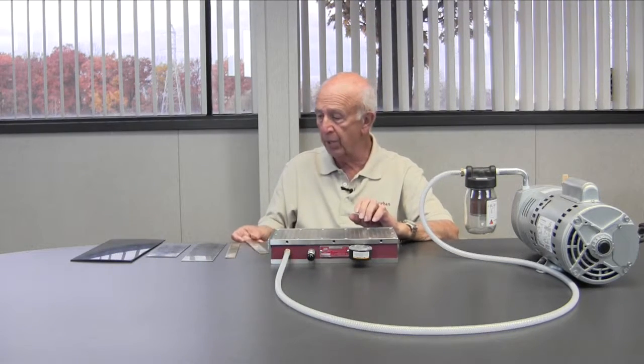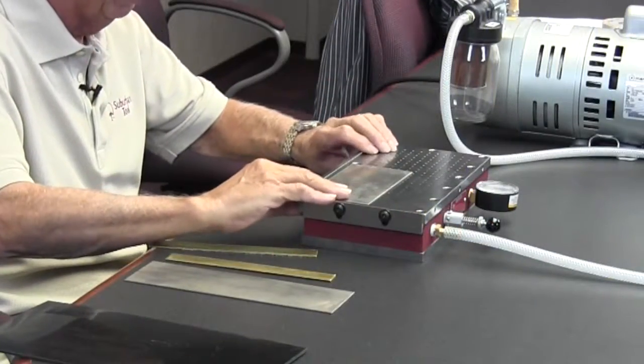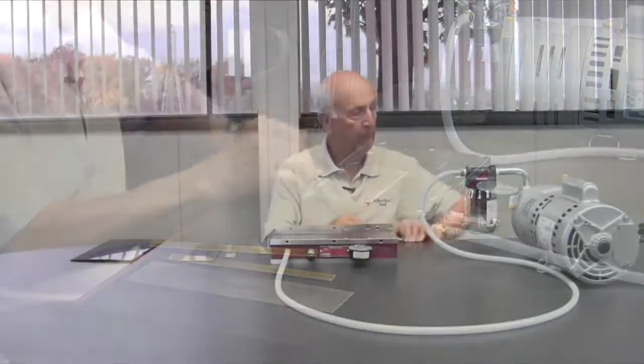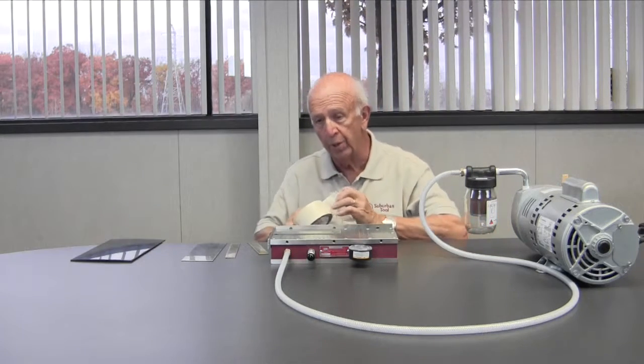It's pretty important when you're using a vacuum chuck that the mating surface that's going to go on there is, in fact, flat. What do we do if we put a part on here? You're going to want to know what to do about all these holes. Simple answer: masking tape for one, or you can take pieces of sheet rubber and put it over them.